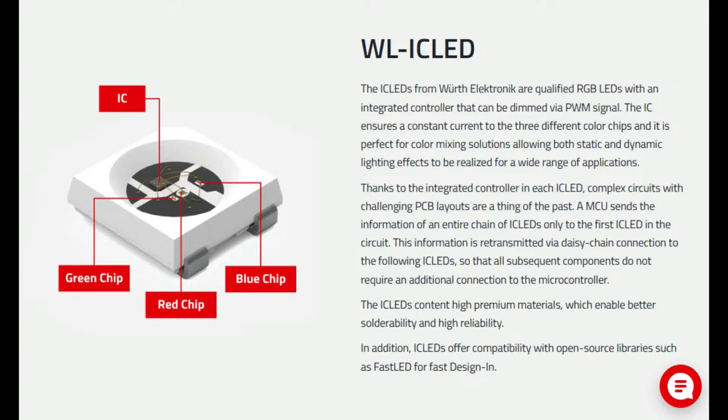It comes in four different shapes and LED sizes that have RGB diodes in them, plus their own IC designed inside that controls it using a one-wire protocol with Manchester encoding — similar to what's called NeoPixel, but some people say WS2812 compatible, et cetera. Lots of library examples work with it, so you're good to go.